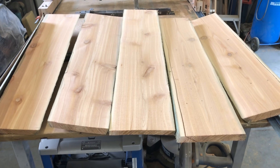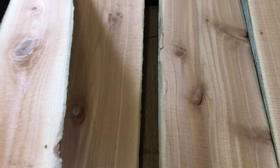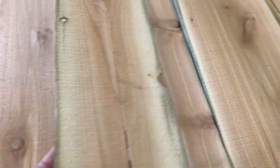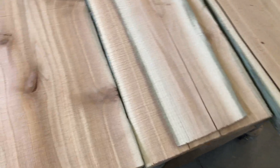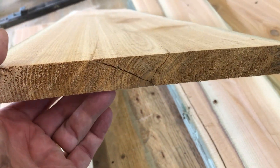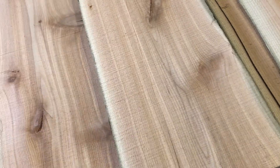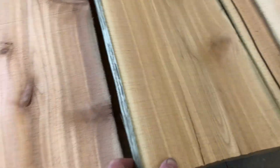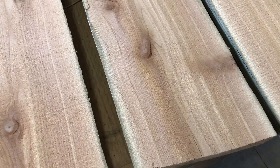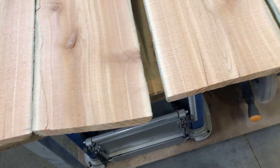That's the raw yield we get out of that log — just some beautiful straight cuts. Really pleased with the cutting of the mill. Even this 1/8-inch piece of veneer was a good test — it'll probably become firewood, but interesting to learn what the mill can do. Our center bit where we have the pith — I'm expecting to cut that right down here and here — and we have just some beautiful quarter-sawn wood. This side is clear quarter-sawn — that's just beautiful stuff. The rest is 5-quarter, which I'll take to the table saw to trim into more dimensional lumber.